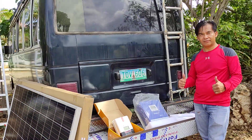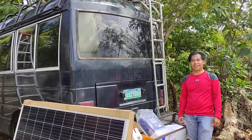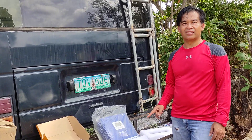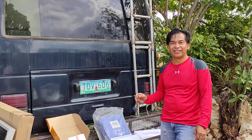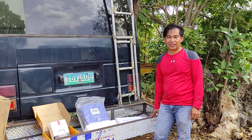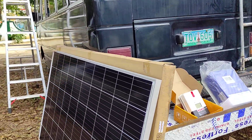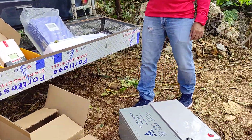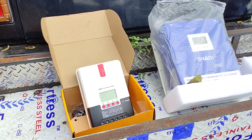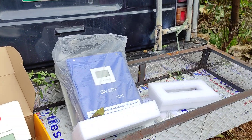Let's look at this bus over here — this is a crazy project. Is this the first time you've installed on a bus? This is my very first time. If you want to see the results, guys, please follow us on Beagle's channel. So again, the components of a solar system are the solar panels, the batteries, the MPPT controller or charge controller, and the inverter, which converts direct current to alternating current.